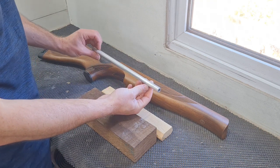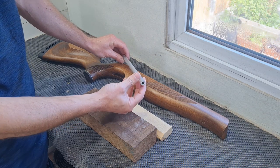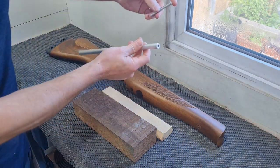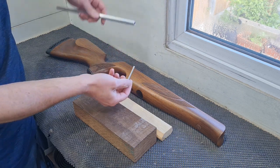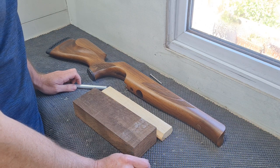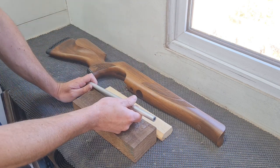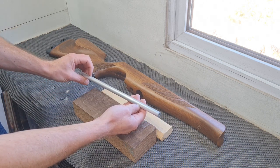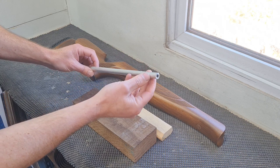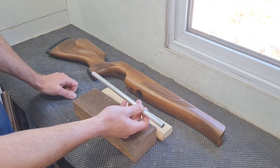For the post itself, I'm going to use a half inch outer diameter aluminium tube. This is 10 gauge, so it's got just over 3mm thick wall, which is absolutely perfect because it fits snugly into the counter bores of most factory stocks for the standard fixing bolts. It's also a really nice close fit for an M6 bolt, which is what the vast majority of sporting rifles use. If you haven't got access to a lathe, aluminium like this is your best bet as opposed to trying to use Delrin or Acetal. It can be cut with a hacksaw, cleaned up in the chuck of a battery hand drill, and it's readily available from any local hardware shop, eBay, or Amazon.